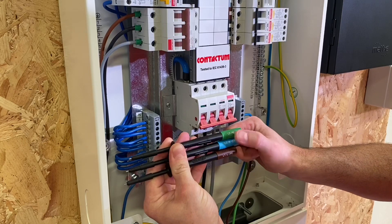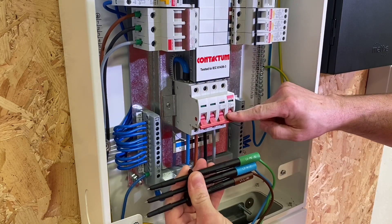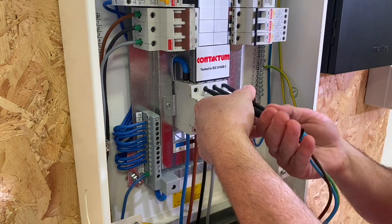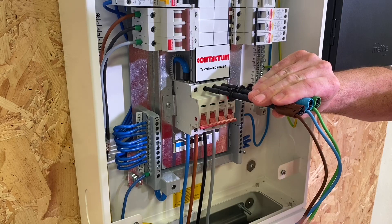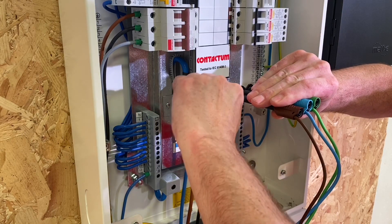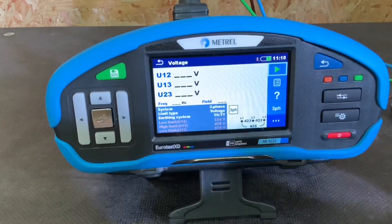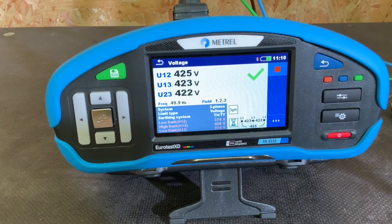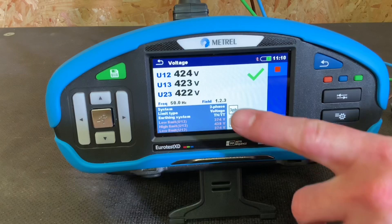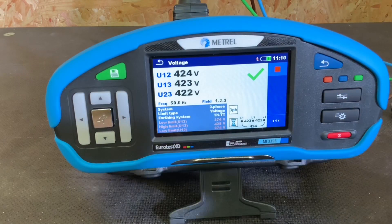L1, L2, and L3 are labeled on the probes. The switch is currently off so I'm going to probe into position, getting them nicely secured while the supply is de-energized. Once I'm comfortably in position I can turn on — so I'm now live. I press the run button, answer yes to the question, and you can now see we've got our voltages for each of the three lines, and more importantly we've got one, two, three showing the correct phase rotation.